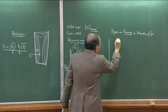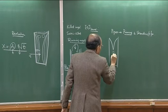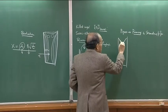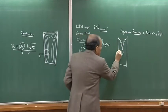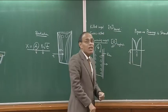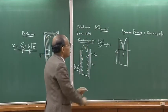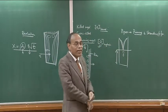The ingots produced through ingot casting can contain many defects; most importantly they have primary and secondary pipes. If pipes form — and this is an ingot without any hot top practice — the top of the ingot and the pipe region come in contact with atmosphere, forming oxides, making this part unusable. The yield of the ingot can be severely limited if such long pipes form because of solidification defects. However, pipes can be completely eliminated by the use of hot top, because the hot top feeds molten metal into these pipes. Secondary pipes are not of much concern because when rolling, they tend to get welded since there is no contact with oxygen.